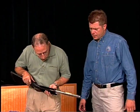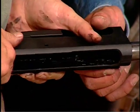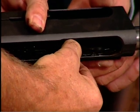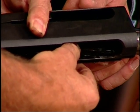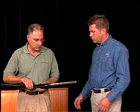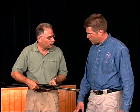While we're looking at this, let's take a look in here. Can we see this? Let's see. There we go, we've got an image of that. Right on the other side of the receiver, you see that there's a lever that moves up and down on a rivet. This is called the interceptor latch. And this is one of the things that gives people a lot of trouble on these guns. The purpose of the interceptor latch is to stop the next round. In other words, the feed latch releases one round, and then the interceptor latch comes up to block the rim of the next cartridge. It's also like an interrupter. An interrupter, right? Yeah. So that it will singly feed, and you won't have that double feed, which is kind of the jam from hell.